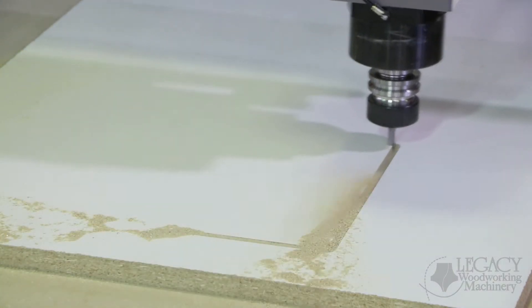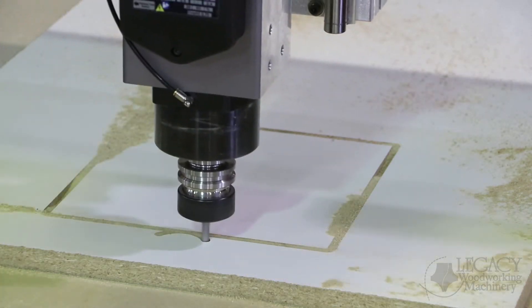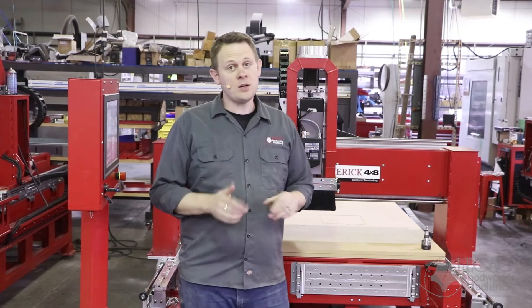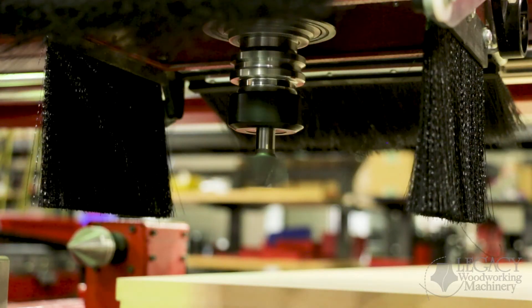If you're already familiar with CNC, you understand the importance of a powerful spindle. If you're not familiar with CNC, you can see this cuts parts faster than you can on your table saw and with a better quality finish. The spindle can be programmed up to 24,000 RPM, which means you can match the perfect feeds and speeds and chip loads for the different materials you're cutting. It also rotates in the clockwise and counterclockwise rotations, which accommodates for left-hand and right-hand spiral cutters in the marketplace.